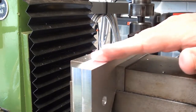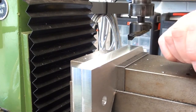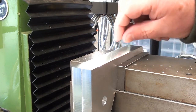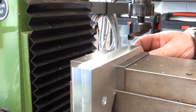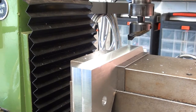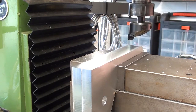While this is clamped here like this — yes, it is nice and smooth, and these are nicely lined up. I'll set the DRO and then I'm going to drill and tap the mounting holes for the braces on this end, and then I'll take it out of the vise. Use some thinner parallels and mount it on this face so I can drill down the clearance holes here, or maybe even drill through here so I can take the parallels out quite easily. I think I'll drill and tap these holes. These are not critical — obviously I'd like to get them as close as possible to the drawing spec, but within up to half a mil would be quite adequate because there's a certain amount of wiggle room. It's just for the clamps. Okay, another set up required, back in a minute.